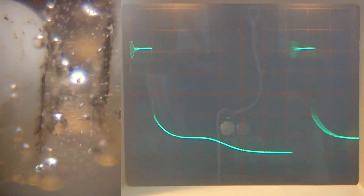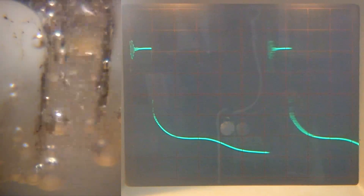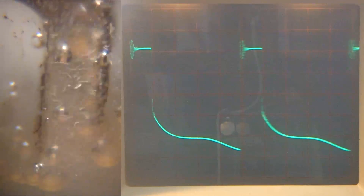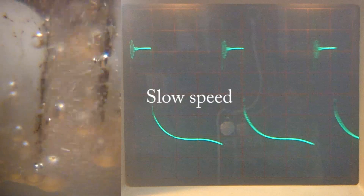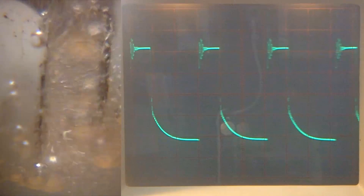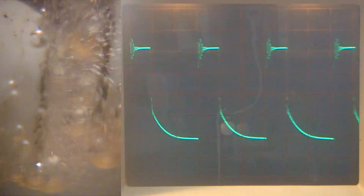I'm just going to change the timing. So I'm doing this so that I've got this waveform and the associated bubble activity, and I'm hoping to see something that might be interesting. I'm just moving along one division, so 5 microseconds at a time, to see if there's anything interesting. And there's no real current flow. My snubber resistor that's taking out that ringing is getting warm — I'm aware of that.